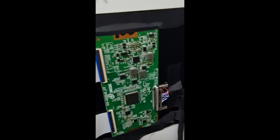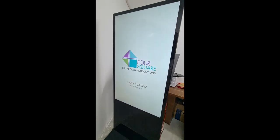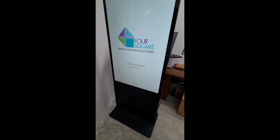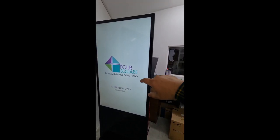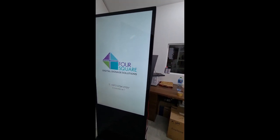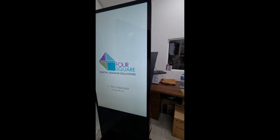Now we will switch this on. We'll check his display. You can see the full display is coming now. You can fix all your short panels like this. If you have a TV with a short COF board, then you can do this process.